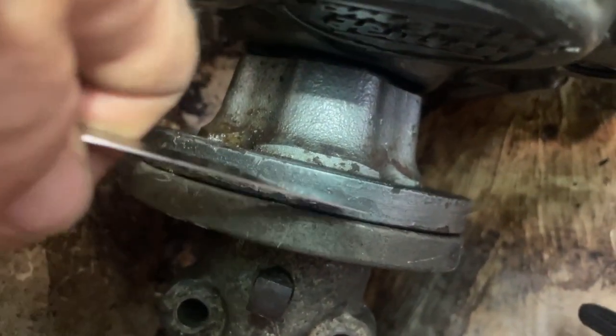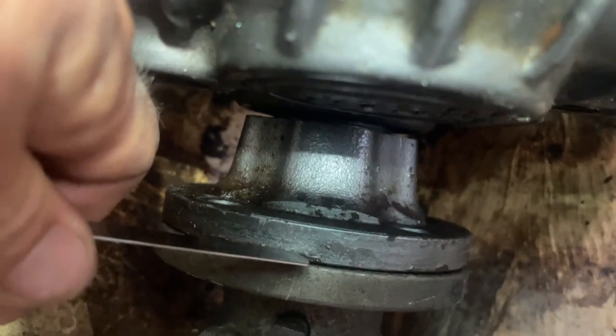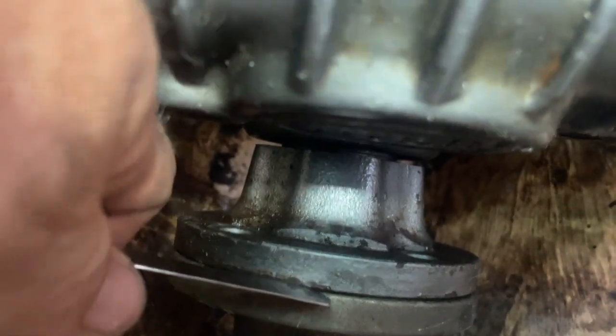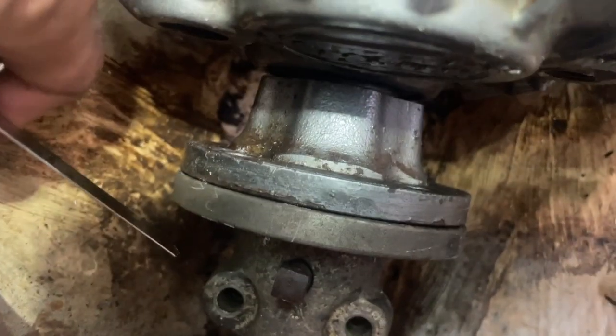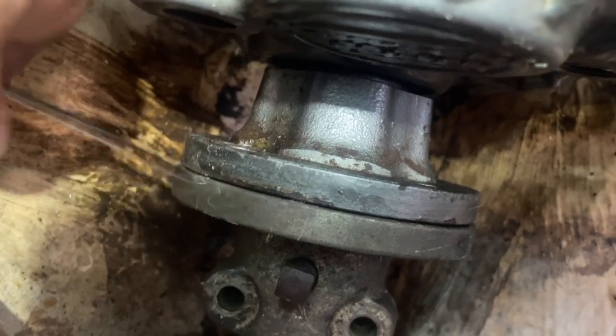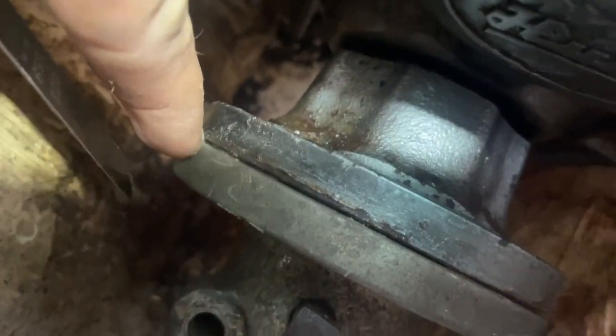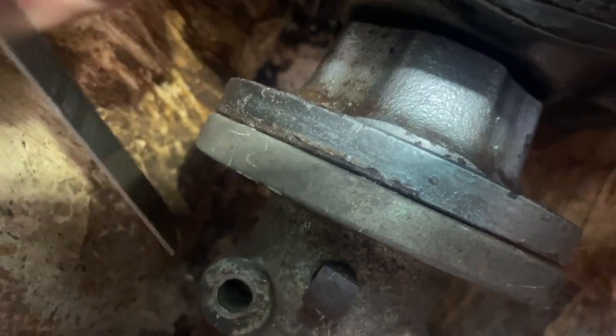And so what I'm going to do is lower the forward part of the engine and raise up the aft part of the engine a little bit by adjusting those nuts on the mounts. Just a few turns and trying to keep it equal, because I think my port to starboard looks pretty good now. I feel pretty good about that. I just need to get rid of that little pinch. So that's next.